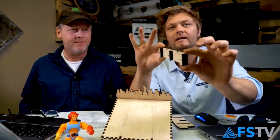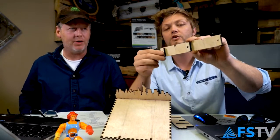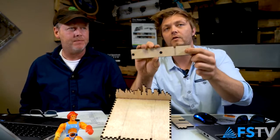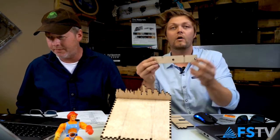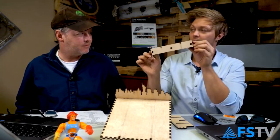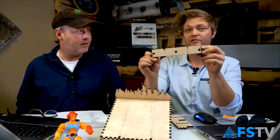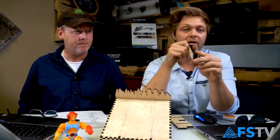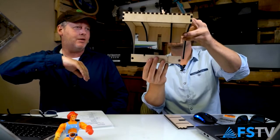So, how do you get it on the wall? Well, this bracket is 2 layers of wood on these little rectangles. Two layers of quarter-inch, glued. And then it has these holes. What you're going to do is just screw this into the wall straight. This is what really everything is riding on. If this is crooked, your shelf will be crooked. So screw this guy into the wall, you have your bracers, and this notches right on. And this will notch right on.